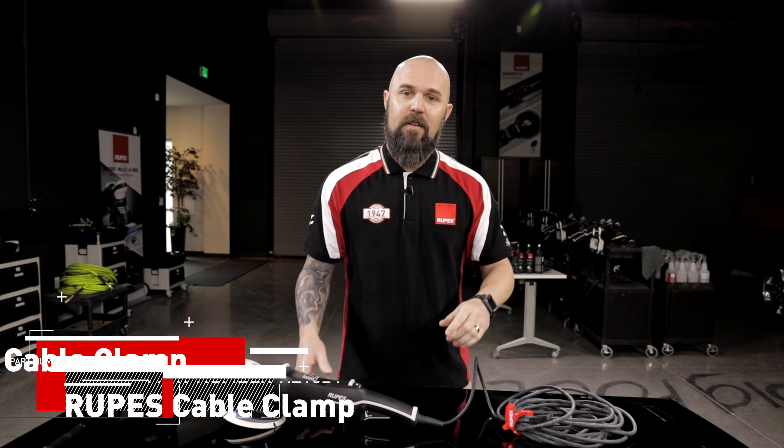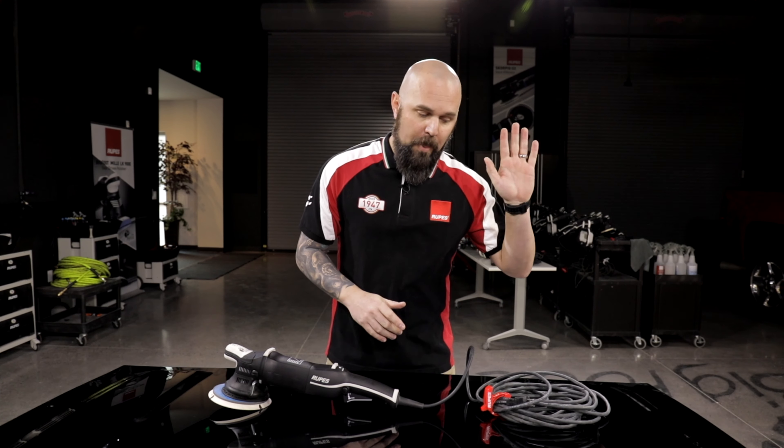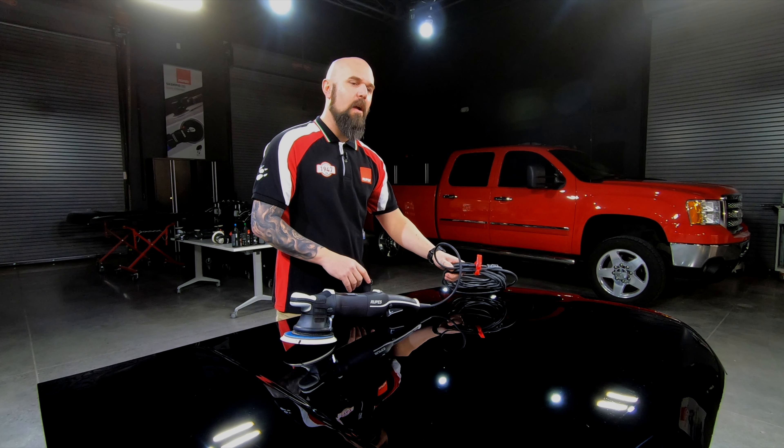Continually flexing a cord with really tight bends, or stretching and pulling at the strain relief, weakens the copper inside the cord. Once it becomes weak, especially when it's got power running through it, it warms up, can get too thin, can break inside the insulation, and you lose power. Without power, your power tools are not going to run. So definitely be mindful and take care of your cords.